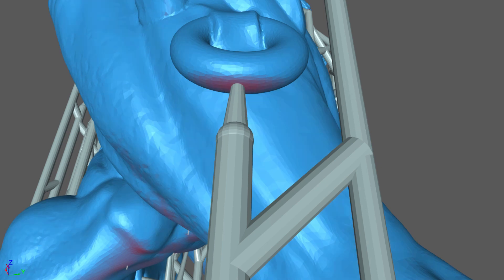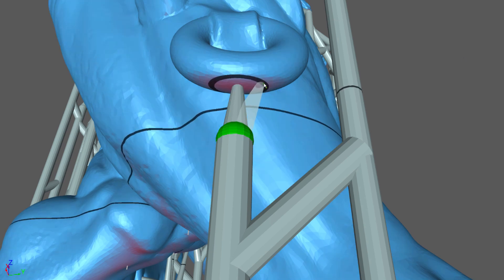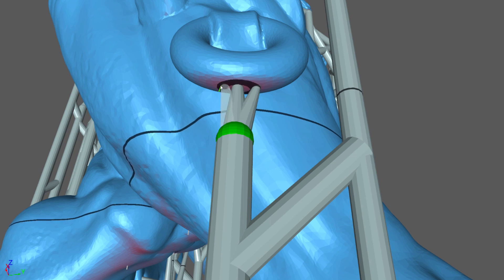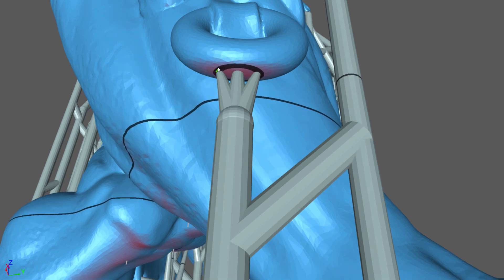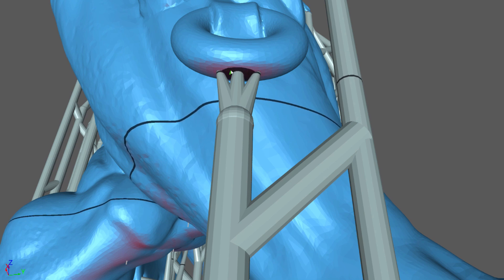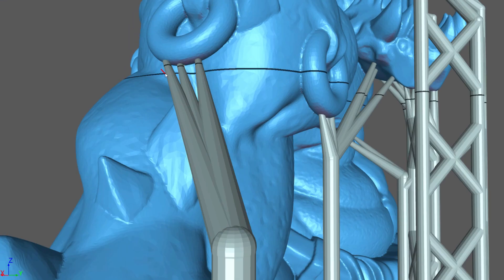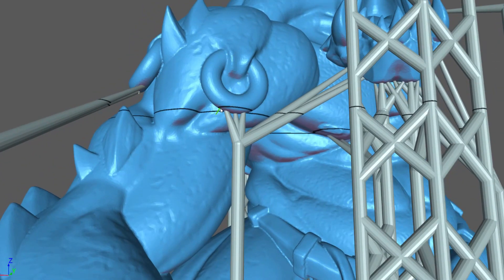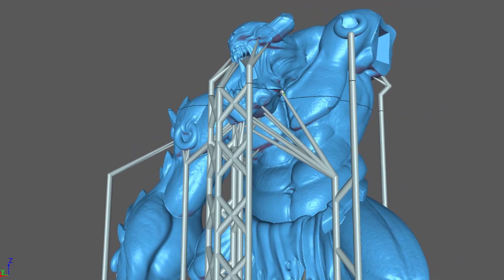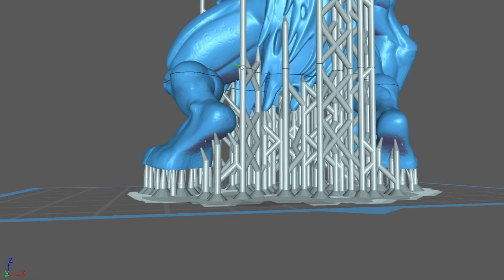You can see how much material it's supporting, so I'm actually going to shrink this support down a little, from 60 to 50. You see it shrink. Now I'm going to double-click on it — the box gives you a clone support — I'll click 'light support' to thin it out a little bit. Now I'm going to make a three-point support pillar, which gives much much better support to that ring. With three points of contact and balance on both sides, it is less likely to pull off that main support and we're going to get a nicely printed ring.